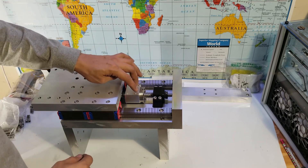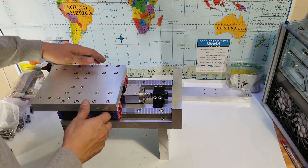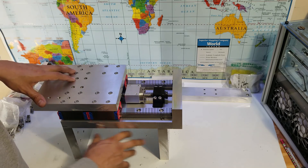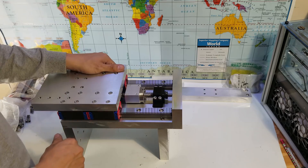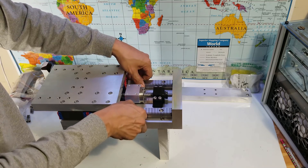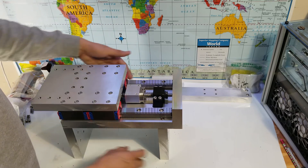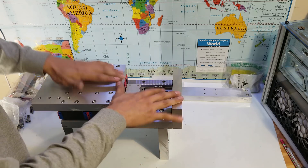I was about to mount the screws to the ball screw, and then I started to think that the space in between here should be really, really tight to the linear rails — and that's on the CNC gantry. So what I did is loosen the screws that are for the linear rails so I can move it a little bit, so I can get to the two screws behind here and loosen this plate, and see if that gives me enough clearance to mount all this to the CNC.